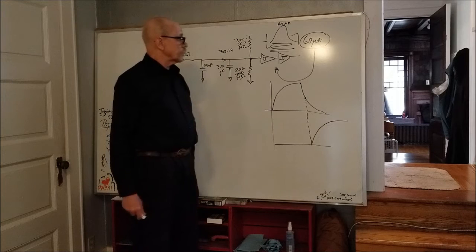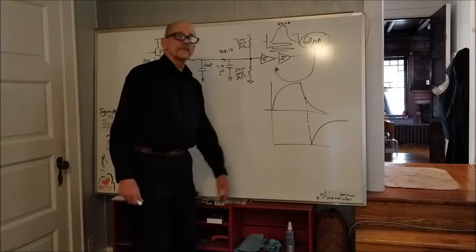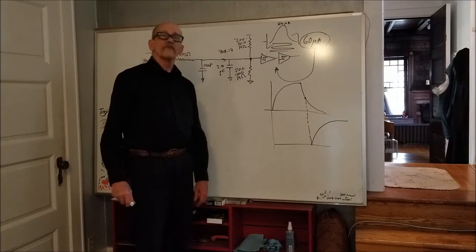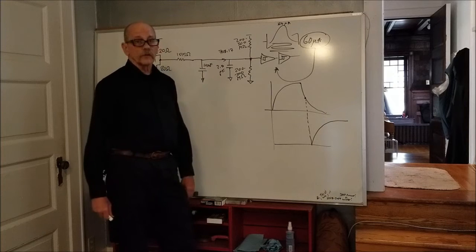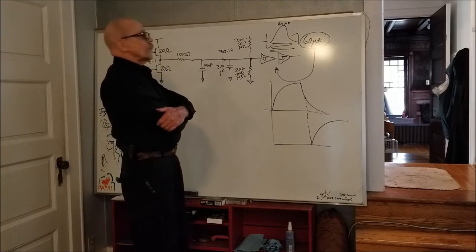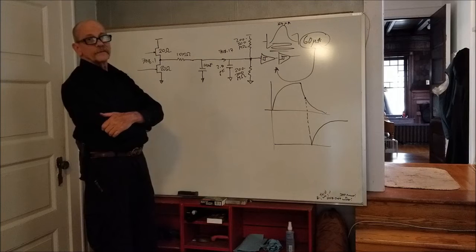But when it was all said and done, the energy consumption of this strategy with two nodes and two RCs, same deal, 60 microamps of current average. That's being averaged by the Keithley with a 10-second average, which is a pretty stable way to measure this type of thing, we found. So at any rate, bottom line is, there's no free lunch. Doesn't cost anything to drive it, but it costs a hell of a lot to receive it.